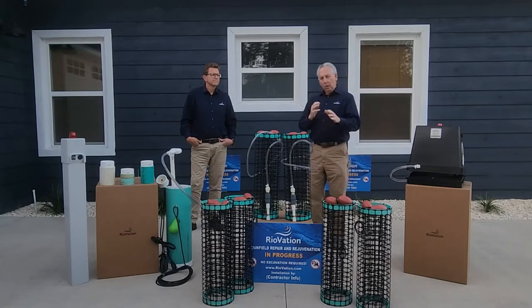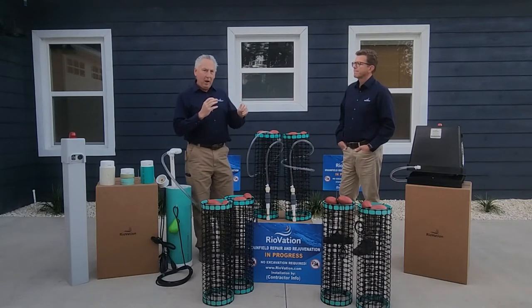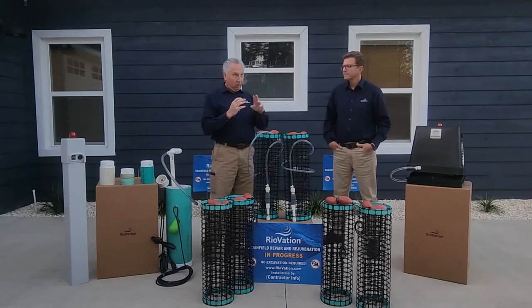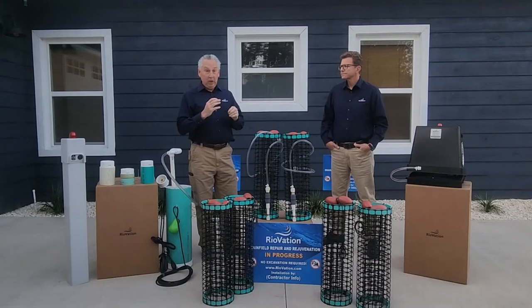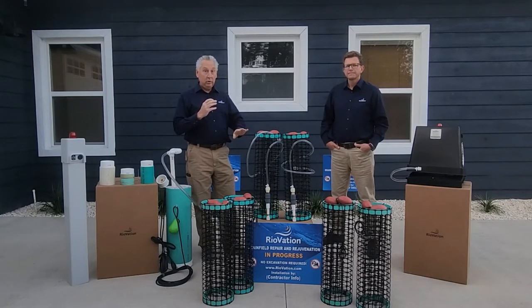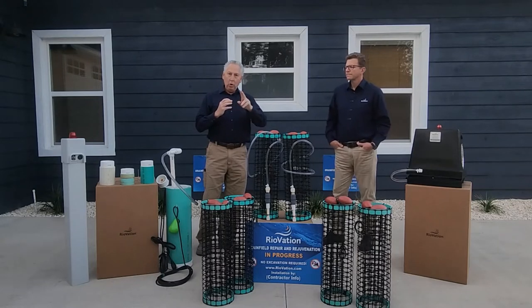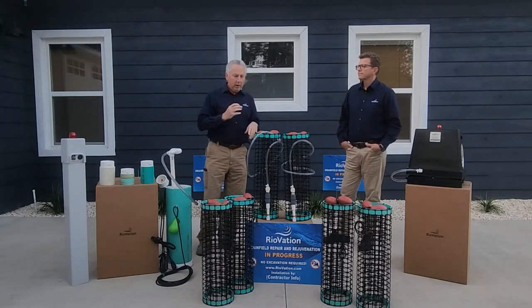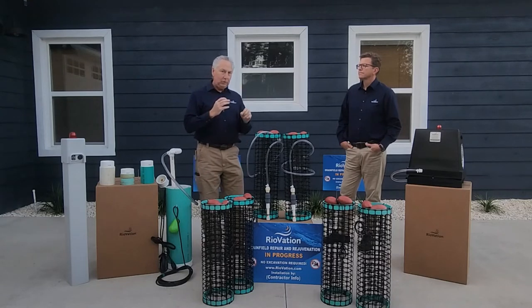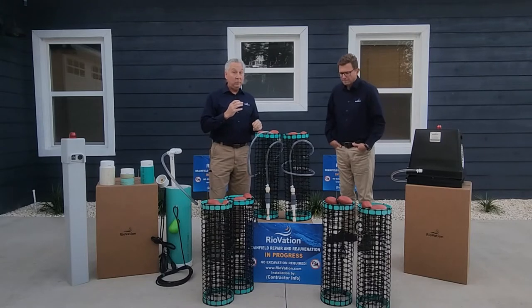The reason this is so productive is we're creating a biofilm reactor that's making single-digit CBOD5 and TSS water, typically within one compartment of the tank or within a single compartment tank. The entire tank is clear and odorless, and we don't require a clarifier because the microbes occupy the media — they're not in suspension. So if you've got a failure because of biomat, the oxygen-rich water kills the anaerobic microbes causing the problem, and the aerobic microbes pushed out consume the biomat, clearing up the drain field often in weeks or just a couple of months.